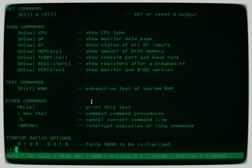However, if you wind up somewhere that's not a BIOS entry point in the ROM, like something I didn't implement, or maybe you've got some other ROM, it will run out of the ROM if that's what it takes. And so some of them are redundant. Like for example, you can remove the code that inputs the line and handles backspace and return and control C and all that, because the ROM code is perfectly fine because it calls other ROM functions to do the keyboard reading, and those are emulated. But I left it in. That's a vestige from when it didn't have BIOS in ROM, that the BIOS emulation was all the BIOS.